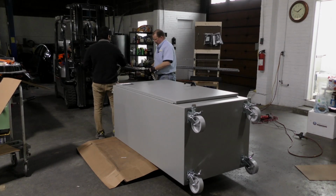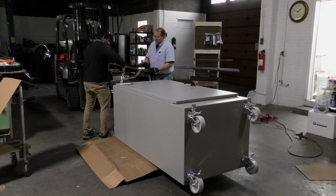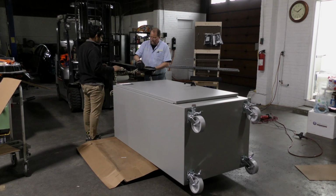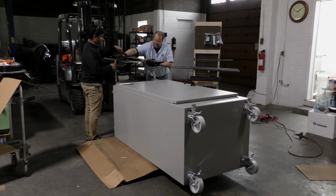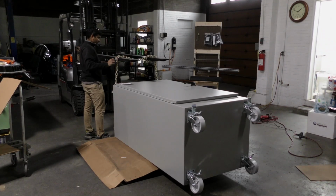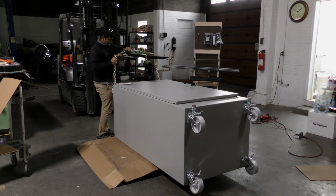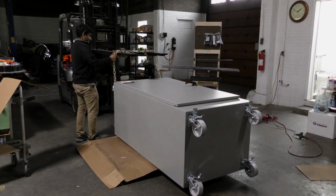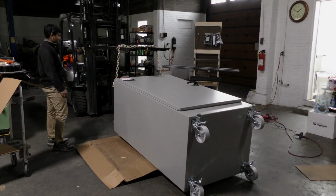And the angle iron and FRP grating. That FRP grid is actually sold as grating. It's chemically resistant, it's non-conductive, it lasts forever, it's virtually indestructible. And they make nice drain grates now. You're familiar with seeing these grates always rusting away, because what they do is screen out stuff from water drainage. But these fiberglass reinforced plastic ones just don't corrode or react with chemicals or anything. So we're kind of using those as the shelves in the PowerSafe 100.